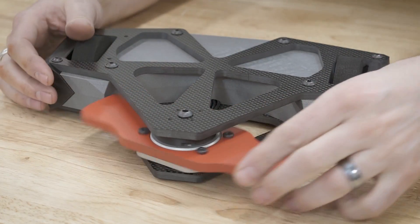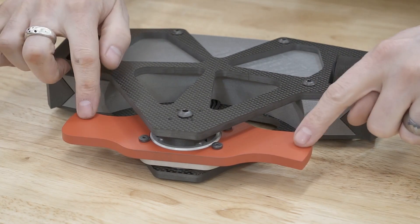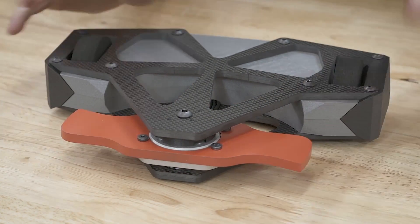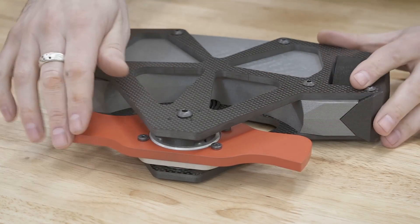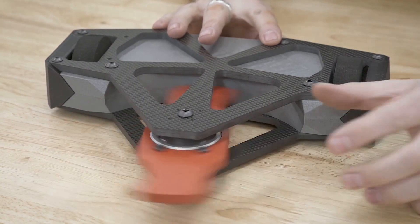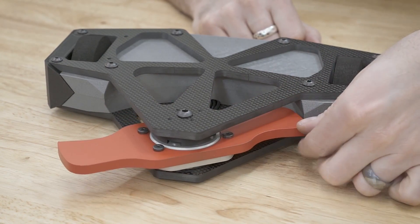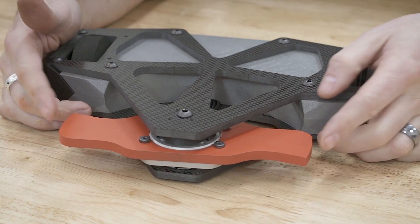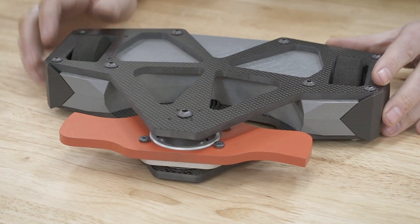The weapon up here has gone from a 3/16 inch AR400 up to a quarter inch S7, and this is a much beefier blade. Fun fact, this was supposed to have a disc as well, but the disc ended up being unbalanced and I just ran out of time, so I'm just running with this blade. This is about 400 grams — significantly heavier than the previous weapon, which was about 300 grams, so about 30% heavier and significantly smaller. The other blade was 12.5 inches; this one is 8 inches. So it's a lot smaller, thicker, and denser.